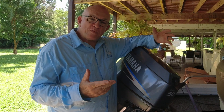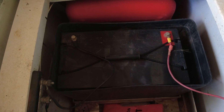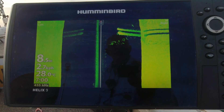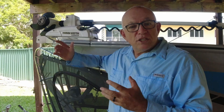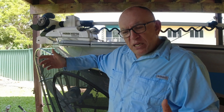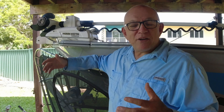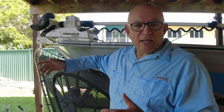My little fishing boat has got two batteries in it. I run a separate battery for the electric motor up the front, and the battery at the back just runs my sounder, lights, bilge, and stuff like that. That's really important because if I didn't have a separate battery for the electric motor, every time I use it, it creates a lot of draw and puts interference on the sounder — and I just want a nice clean sounder screen. The reason I chose a lithium battery to run the Minn Kota is that lithium batteries allow you to use nearly all of their capacity. A 100 amp hour lithium battery can draw down to 80% of its charge, where a 100 amp hour AGM battery can only draw down about 50% before it's done. So effectively a 100 amp hour lithium gives you 80 usable amp hours versus only 50 from an AGM.